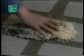Next, excess material is removed using a palette knife and wood shavings. The panel is finished by pouring in more liquid plaster until all the intermediate spaces are perfectly filled. Then, using a fine sieve, you sprinkle sand over the entire surface to absorb any remaining dampness. This last procedure can be repeated various times. Wood shavings are used for a final cleanup.